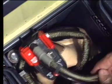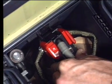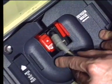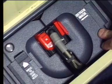Engage the mask assembly with the regulator on top. Close the left flap door carefully while pushing the reset test slider to retract the oxy-on flag. At the end of the restowing operation, do the in-situ testing.